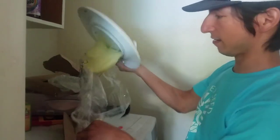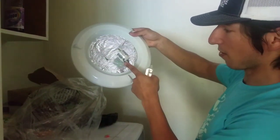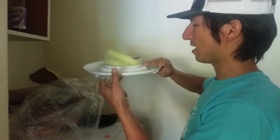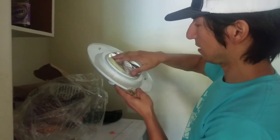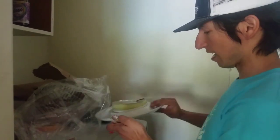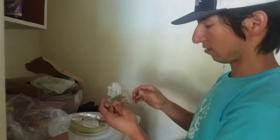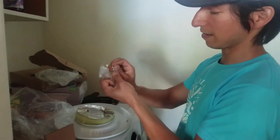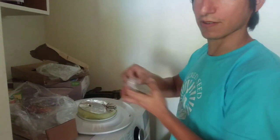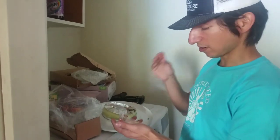Oh, and there's... Okay, I see. So what we have here is basically something you screw a light bulb in with a black power wire, a white common or neutral wire, and your bare naked ground. And basically we're just going to use a bracket that has been supplied with the kit to attach this fixture up there. Before we do that, we'll attach the wiring with the wire nuts, and it's pretty much color coordinated, black to black, white to white, ground to ground, and this shouldn't take more than a minute.